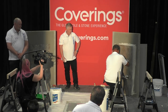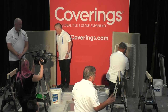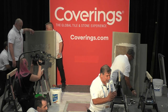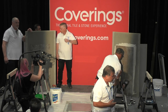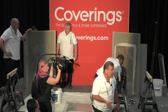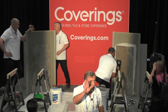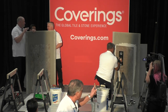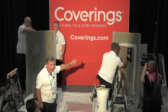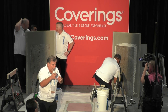Does that surface need to be flatter? Yes. With thin tiles, those surfaces need to be flat. Whereas before we could cheat it with mud — although we weren't supposed to, but we did all the time — now there's no more cheating. That tile is too thin and it'll actually bend and bow and follow the wall. Especially with a cementitious product, as it cures it's going to pull and draw into the wall. So now more than ever, surface prep is important.